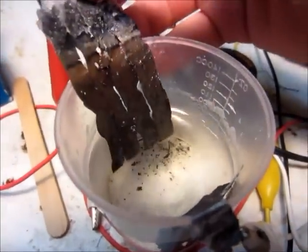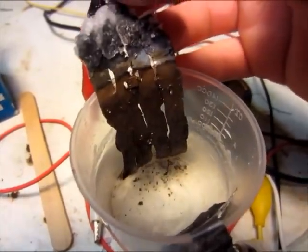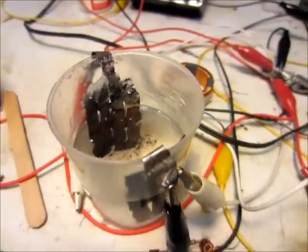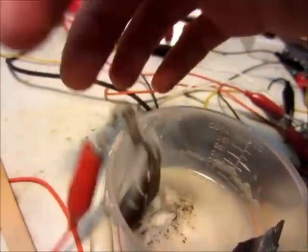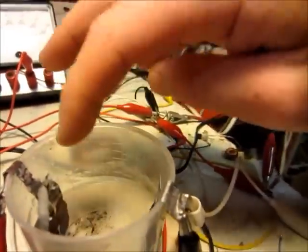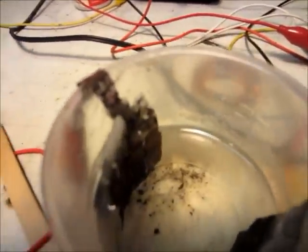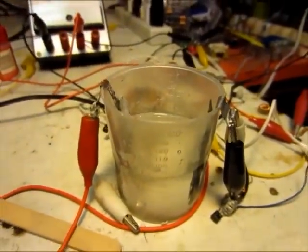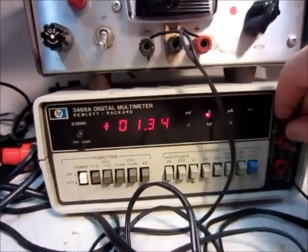It's not at the end of its life yet, it's starting to fall apart a little bit, and as you can see there's some black stuff in the bottom. The max amp output is about 130 milliamps, so that's not bad. But I'm having the same problem a few other people have noticed - there's alum crystals growing up all over the positive side and even outside. There's a little bit on the inside because I've let it evaporate down about a quarter inch and haven't filled it up with water lately. But there's absolutely no crystals on the negative, which is kind of weird. I've let this sit for about a week without being charged, and it's staying about 1.35 volts.